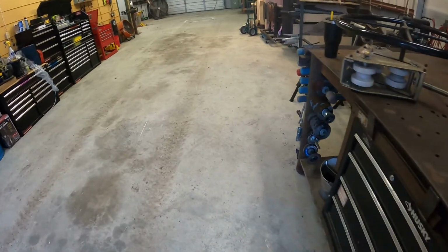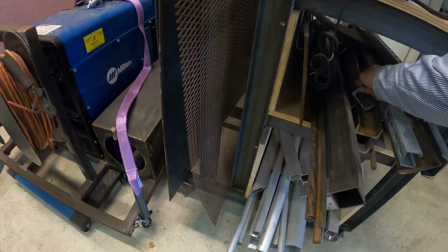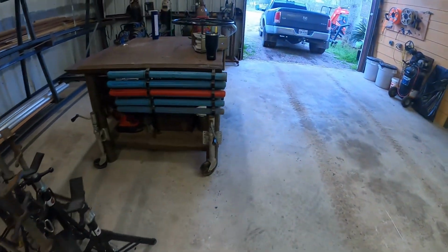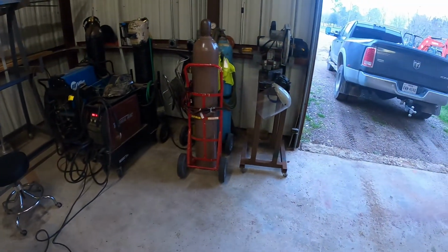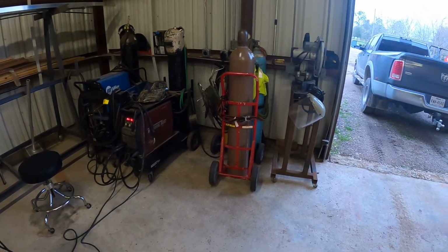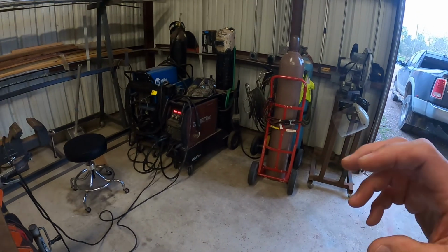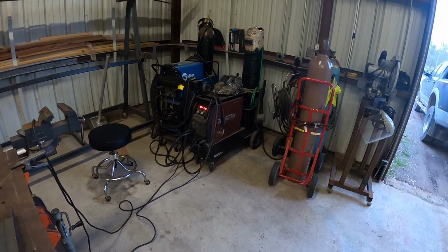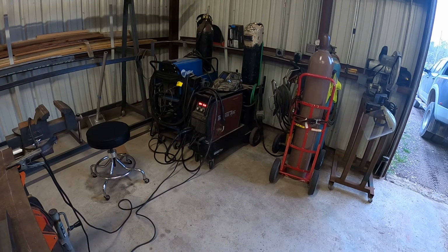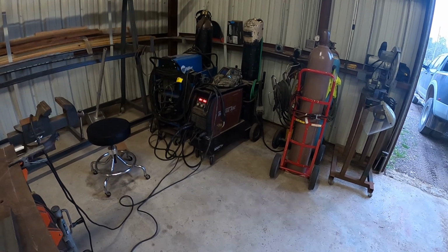I know a lot of people on YouTube talk about setting amperage on machines. Man, to be honest with you, I welded for many years, and when you got one machine, like when I had my Lincoln 200 on my rig truck, I welded with it every day, so I kind of knew what my amperage was. But when you go to these electric machines and other machines you're not used to, you got an idea where you need to start on certain rods, but it's all about looking at the puddle. You got to see what that puddle's doing to really know what amperage to set your machine at. If it's burning too cold and building up in the middle too high, then you know you're too cold. You need to turn it up.